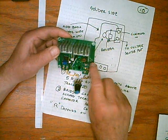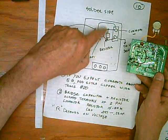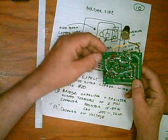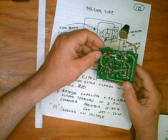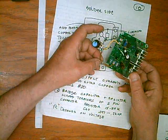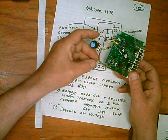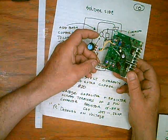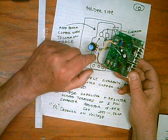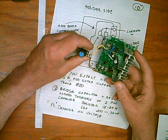The capacitor we took out of here we can use over here for the filter. Across this terminal we also have the voltage divider resistor — I have two here because I didn't quite have the right value. I usually work at 60 volts when testing this for 50, and I needed to add a little extra resistance. I use a 300K resistor and a 50K pot. I use 300K because it has a 2 kilovolt flashover rating, and you want to use at least a half watt resistor here. A 270K would work — anything down to 240K. You'll have to change the values a little bit, and I'll talk about that in the next video.